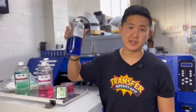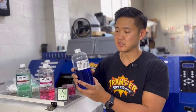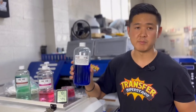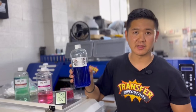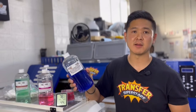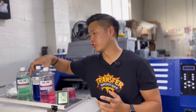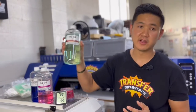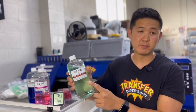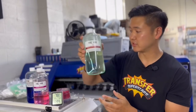Next is going to be cleaning solution. I carry two cleaning solutions, both from DTG Pro — both concentrated. First is the medium strength cleaning solution, which I use first if there's ever a clog or any banding. I'll put a link below for this. I also have an extreme cleaning solution for heavy clogs or heavy banding when I need to soak the printheads. If the medium solution isn't strong enough, this is what I go with.